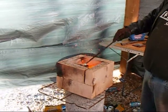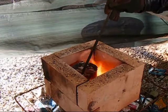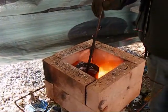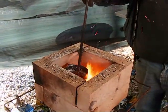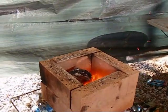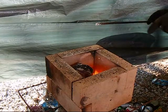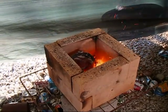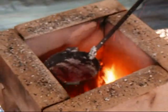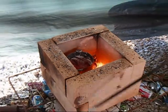What I've got in here is one of those little one pound propane cylinders that I have cleaned out, made sure that all the propane was out of it, cut the top off of it, and then I've taken quite a few aluminum cans and melted them down. If you look inside, you can see that fan is putting out quite a lot of heat. I'm right to the end here — we've already melted down a bunch of cans and poured it. If you look down here, we've got six ingots already.